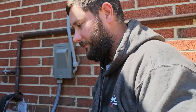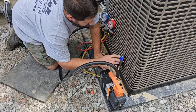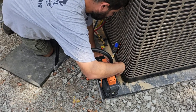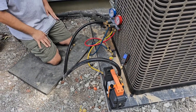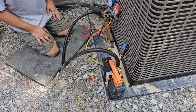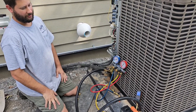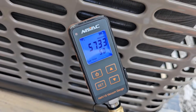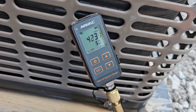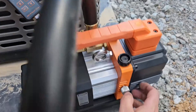With the hose connected, turn on the vacuum gauge, then open the ballast, turn the shutoff on, and turn the pump on. You can hear it starting up — it's super quiet. Once it hits 3000 microns, close the ballast. It's not going to take very long to hit 3000.